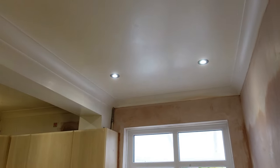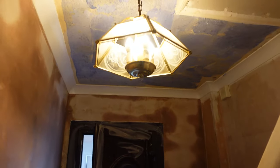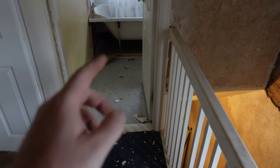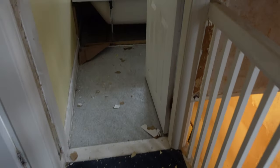They're done, they're in, they're looking nice. Turn them on — mint, brightens it up as well. On to the next job: putting spotlights in the hallway. Let's go upstairs and see what the floors are saying. On the landing we've got carpet that can come up. I can see from under the bath that the floorboards go this way, so we're going to have to drill holes all the way down. The customer said they're having new flooring in the bathroom so I can rip that liner up and take full lengths of board up.